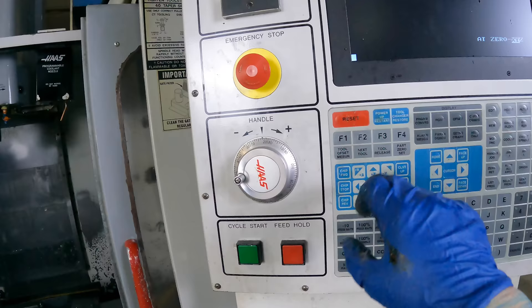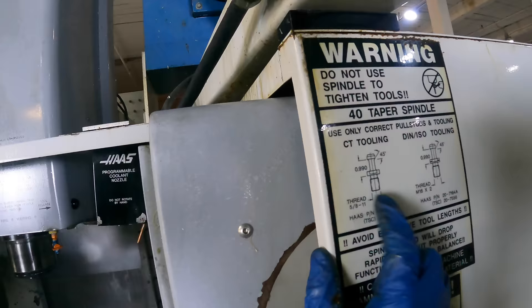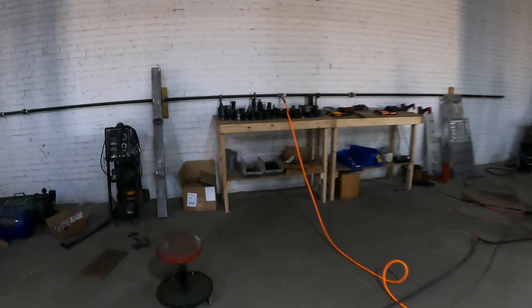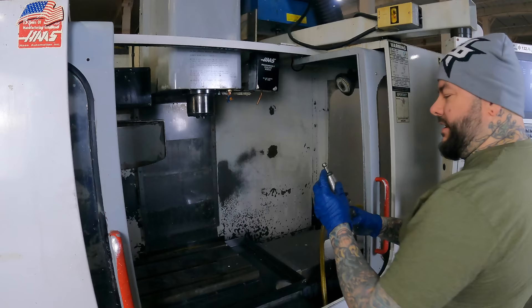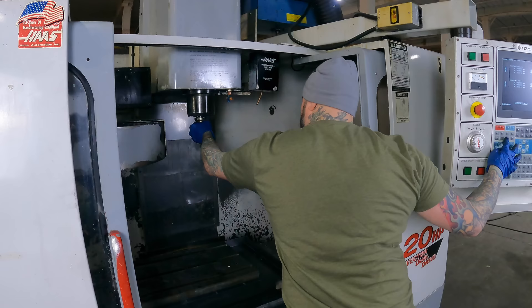Let's see if we can release a tool. I know I have a Cat 40 that fits this. It has the long stud. Let's see if I've got one. I hate to run a spindle without a tool in it. There's a long one — let's see if that one will go up in there. There's my DIY 8-foot hydraulic brake press — if you guys haven't seen that video, go check it out. Let's see if this tool will go up in there. Hopefully that's the right pull stud. It looks like it — went right in there.